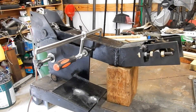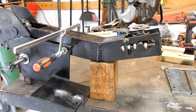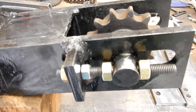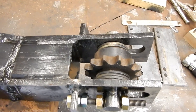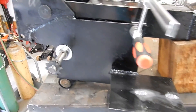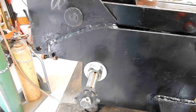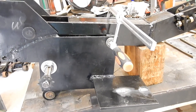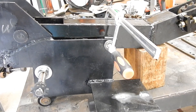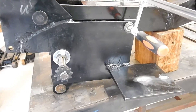You can see where I've gone with it so far — it's no longer straight. We've got it angled up, so it's going to be about an inch and seven-eighths gap in that chain off the bed in the middle. I moved the adjustment back from the end to behind the sprocket, which should make things a bit better. There's your mounting plate for your winch and your drive sprocket coming from the winch. Looking at the 1600s Timber King, they have a plate running all the way from one side to the other, so I may end up doing that to give it added support.